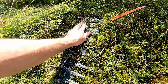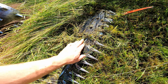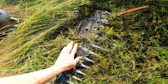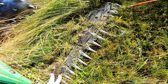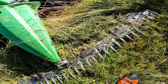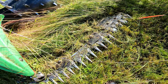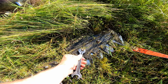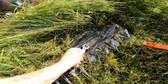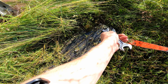It's got some stuff in there — maybe it's not tight enough. The grass goes in here and these teeth are all mounted on a bar that slides back and forth, so there's friction in all of these places. We just want to put our hand on it and make sure it's not hot to the touch. They all feel good, but this one maybe is a little bit too loose, so we're going to tighten it up — just about a quarter turn — and drive it for a little bit and see how it cuts.